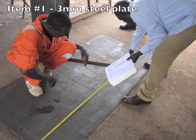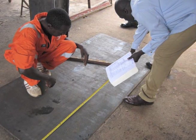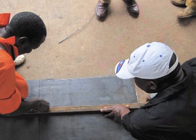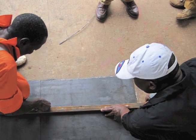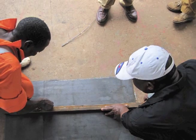One sheet of steel plate, three millimeters thick — in imperial units, that's one eighth of an inch thick. Make sure that you don't use steel that is thinner than three millimeters, as it will bend too easily. If you can't find a sheet that is three millimeters thick, then use four millimeters.